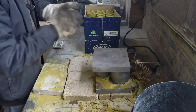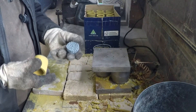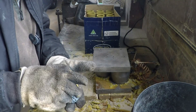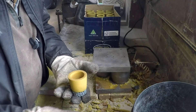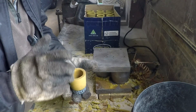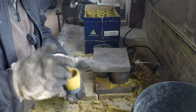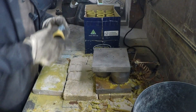What they are is a funnel through which I will pour metal, and the funnel will sit on top of a filter like this — that's a ceramic foam filter. That sits in the top half of a die for making a 4-barrel throttle body. The filter's job is not so much to filter the metal to clean it — it's already pretty clean anyway — it's more to control the flow of the metal into the die.